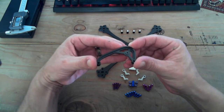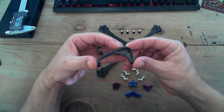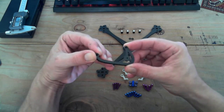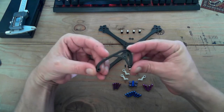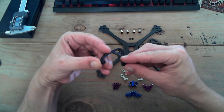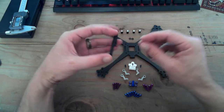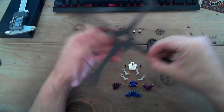To look at the canopy real quick, hopefully this gets a little focus. That's a milled carbon fiber plate, and it's spec'd out to fit our components exactly. So it's super lightweight, it's super strong. This is the flush side that faces out, and internally this is the CNC side, which has a little bit of an extension here to make sure it grabs the micro well, which we'll get into with the components in a little bit. Okay, so let's just throw some screws in here and start.